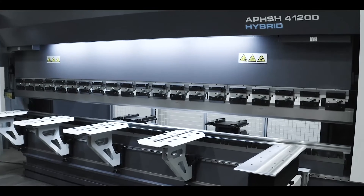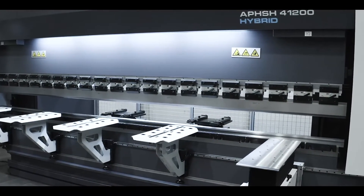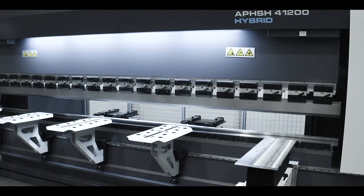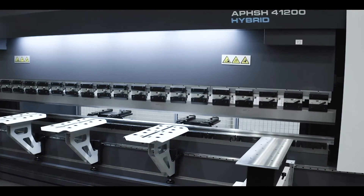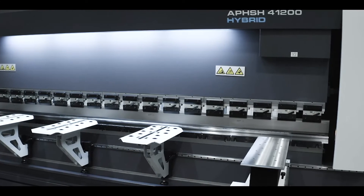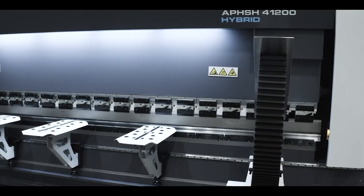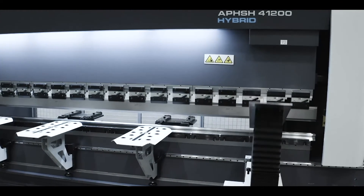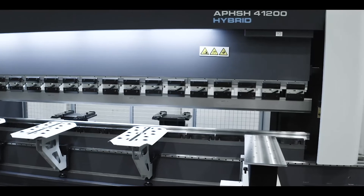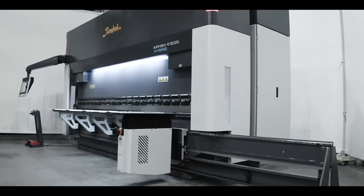The core configuration — such as the area ratio of the upper and lower chambers of the oil cylinder, the size of the oil pump, the power of the main servo motor, the form and size of the filling valve, and the integrated response of the oil circuit — are optimized, which reduces the cycle time and improves efficiency by more than 30%.